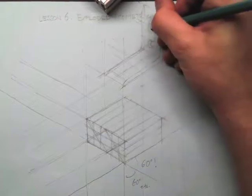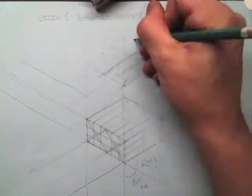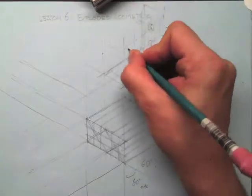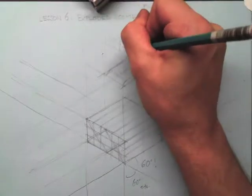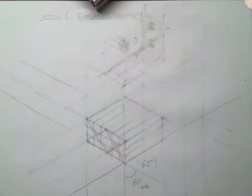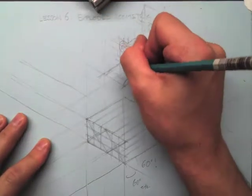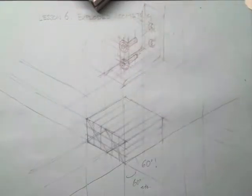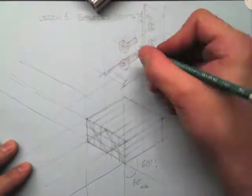So now I will move out along the x-axis and draw the screw that fits in the hole in the bracket. The screw should align on the center line, and so I'll draw a cylinder that's centered on that center line that's shared with the hole, because that's the significant or critical alignment of this particular subassembly or part. I could also move these further out along the x-axis so that they have their own space, but my concern in laying this out here is that I would then run into the third piece of 80-20, which we will get to eventually. So remember that this is an art more than a science.